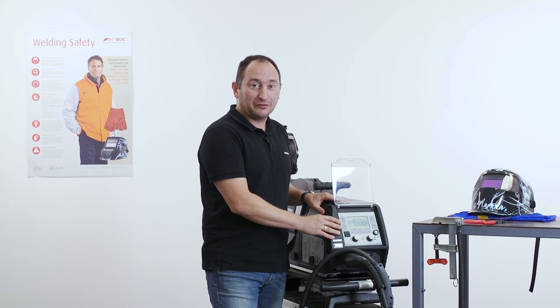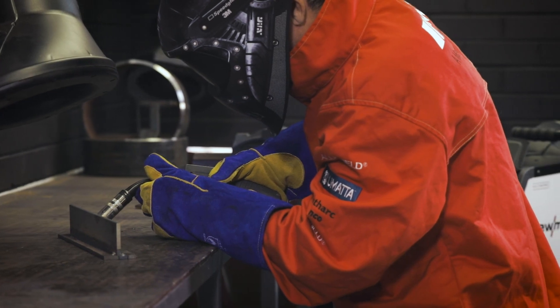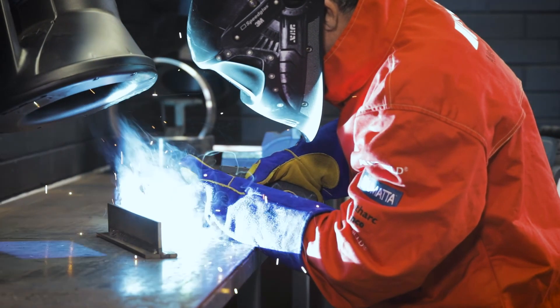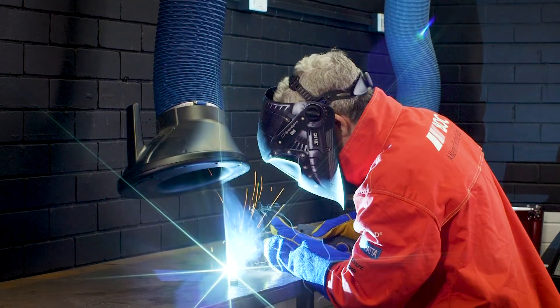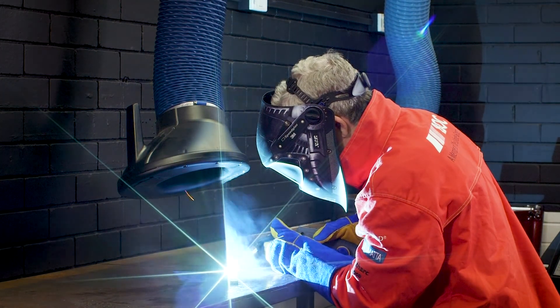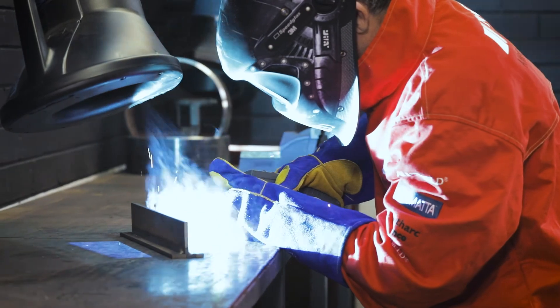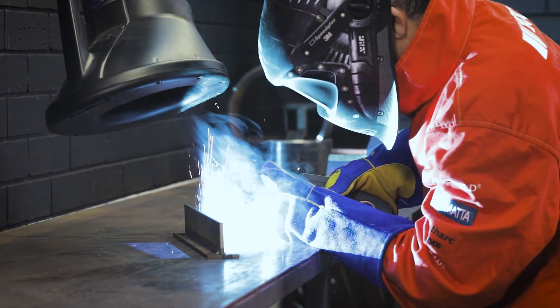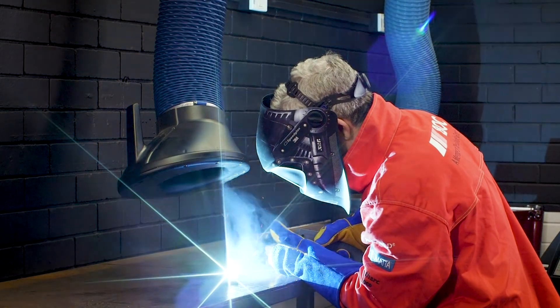Now we are ready to see the possibilities of the Expert 2.0 panel in the workshop next door. Just before we start welding, be sure to have the appropriate PPE: welding gloves, welding helmet with the correct shade lens, fume extraction if inside an enclosed area, and appropriate clothing — long sleeve shirt, long pants, and enclosed shoes. Today we are using ArgoShield Universal as a shielding gas, BOC bronze coated 1.2 mm mild steel MIG wire, and we'll be laying down a 6 mm fillet weld on 6 mm mild steel plate using pulse mode to reduce spatter.